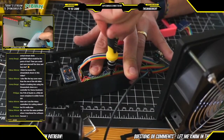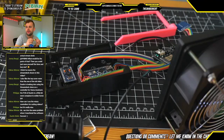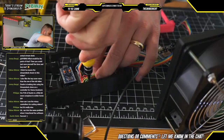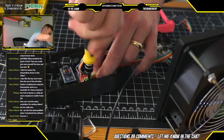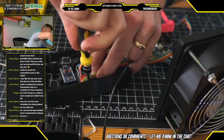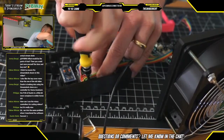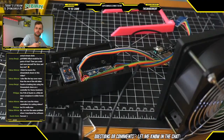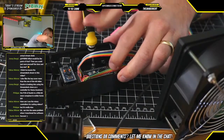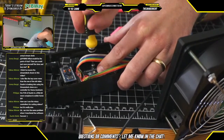In terms of actually inserting the screws into the plastic, typically if you're threading a fastener into a material, you have to pre-thread the holes. I have found that with 3D printing, if you just oversize the holes a little bit, you can use the screw itself to cut threads into the plastic as you're tightening everything down. So that's what I did here. If you're going to build these, you don't want to have to buy a set of taps to pre-tap the plastic before inserting the screw. The motivation was to make things easily assemblable with tools you may already have on hand, or requiring a minimum amount of new tools.